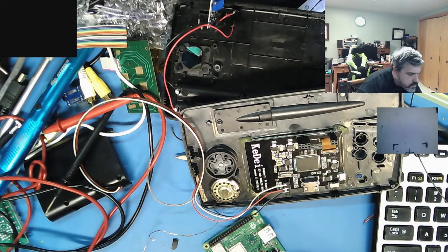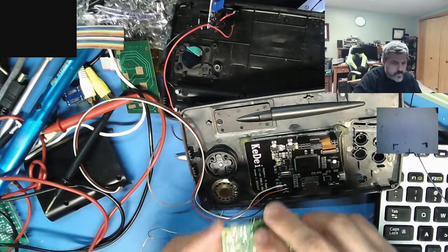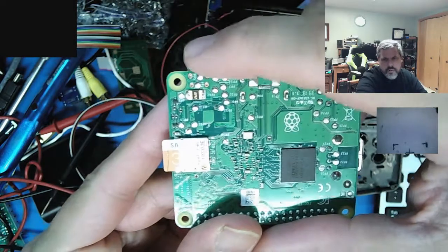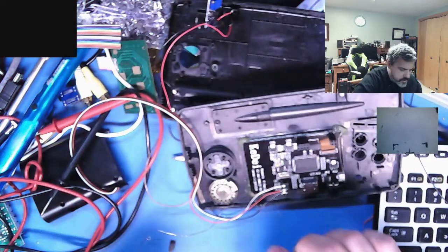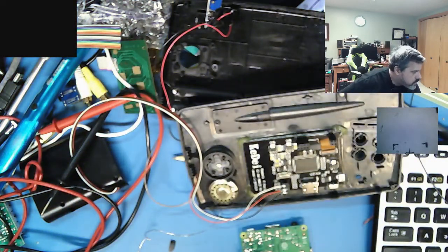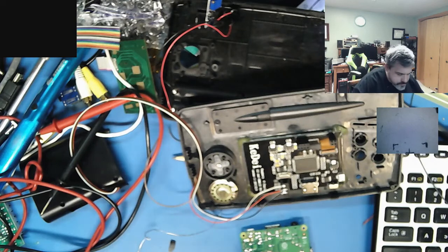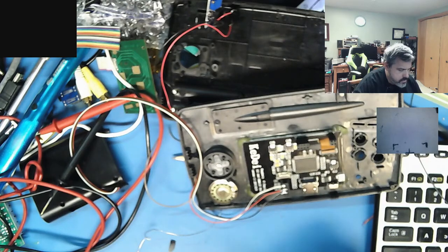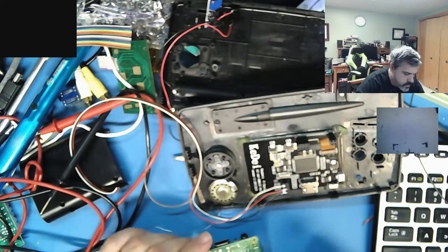And since I'm here, what I wanted to do is figure out which pin on the Pi itself is which. I can never remember on this guy here. This is your connector coming in, micro coming in, and one of those is the ground. One of them is the power line. It's actually going to be pretty easy to tell because you just go from the ground on the board, which is going to be the same as this, because the shield on it is going to be the same as the ground. So you've got two points.